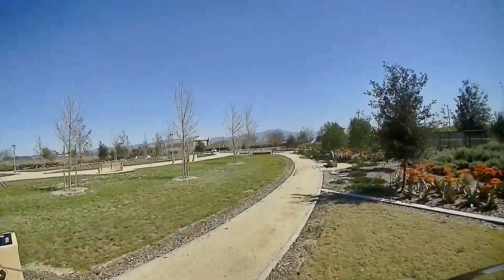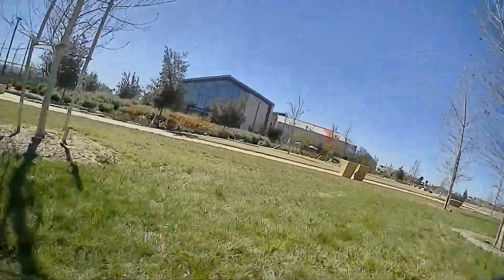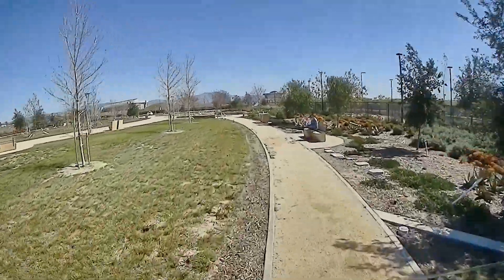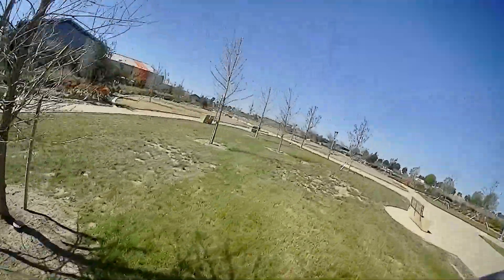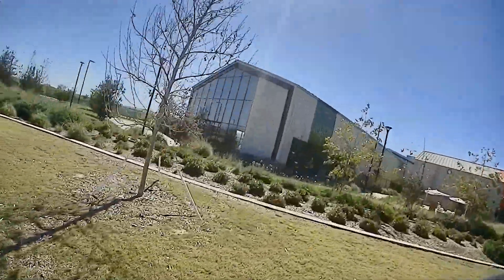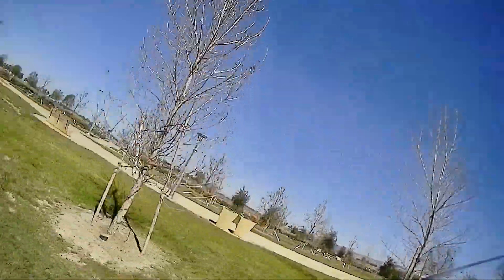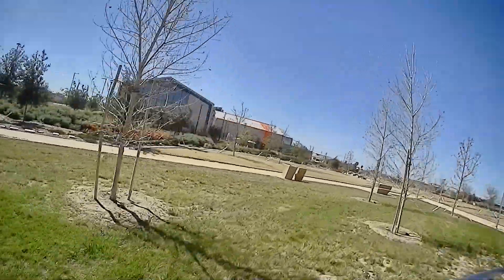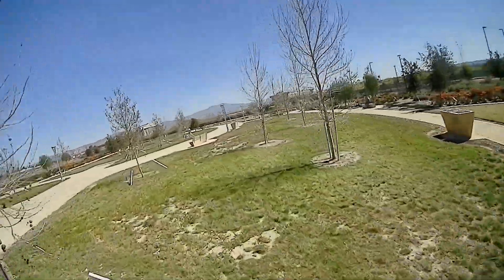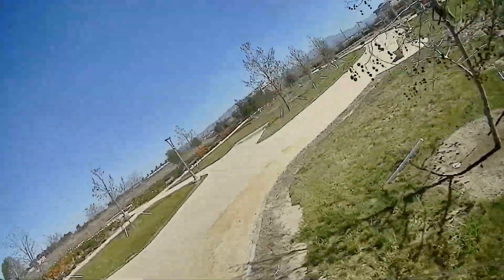I'm not even sure if the prop sounds are coming out on the microphone — it's pretty quiet. I think on this KV the filter values are going to be a little bit different. Getting a little bit of oscillation in the video; it's probably just jello and vibration from being a little bit out of tune. These are pretty close to stock Betaflight and I haven't upgraded it — it's like an older version, 4.2.3, I think, is the version on here.